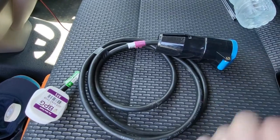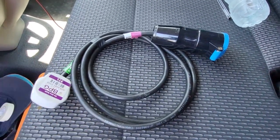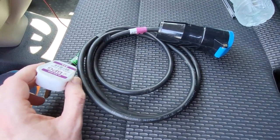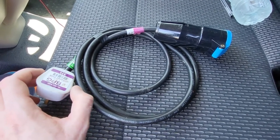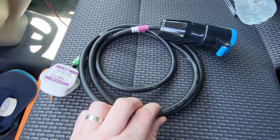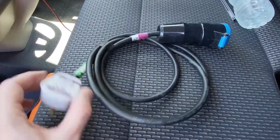So even though you've got a 16 amp connector on there, you might think that's going to take 16 amp — but that's not right. You're only protected up to 13 amp. There's no possible way of pulling any more than 13 amp because the fuse will give protection. So if there is a fault with the cable anywhere down the line, you're protected because you're still fused.